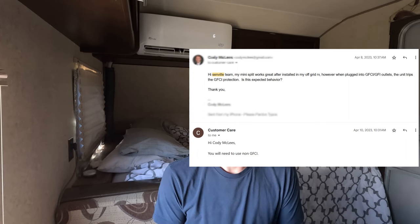Now some of the cons. One of the biggest cons I only discovered recently is that the unit cannot be plugged into a GFCI outlet. It currently is not plugged into a GFCI outlet in the trailer; however, if the trailer gets plugged into a GFCI outlet, it will pop it as soon as the compressor kicks on. When I emailed Senville, they confirmed it cannot be used with a GFCI outlet — and if you look at tiny home, camper, or mini split forums, you'll find other people have similar complaints across the brands. So if you're planning on mooch-docking and plugging into a GFCI outlet attached to someone's garage, know that you cannot run your mini split on that circuit.